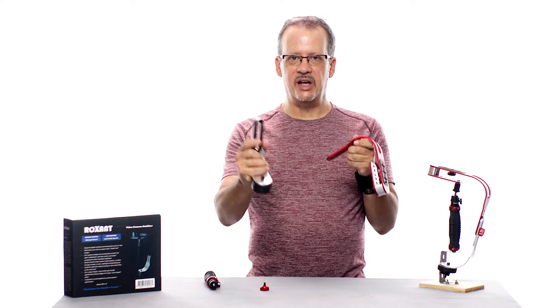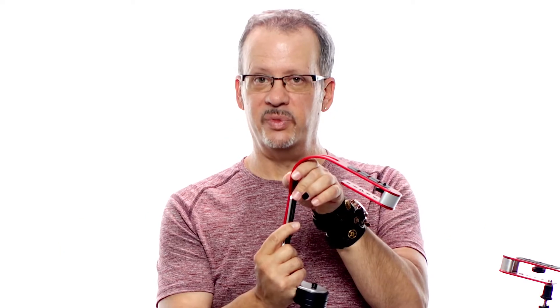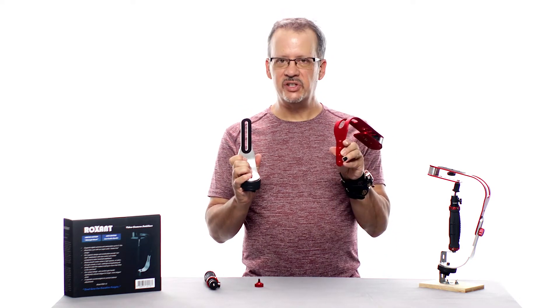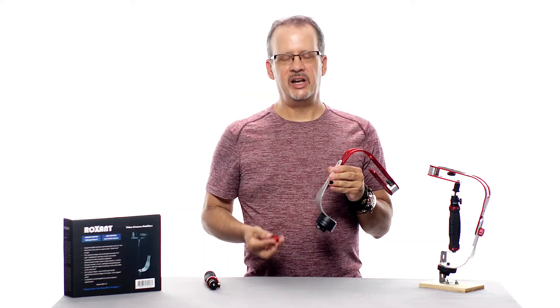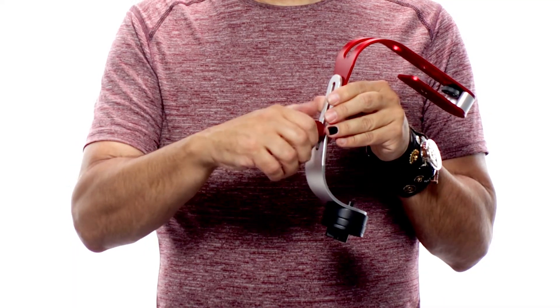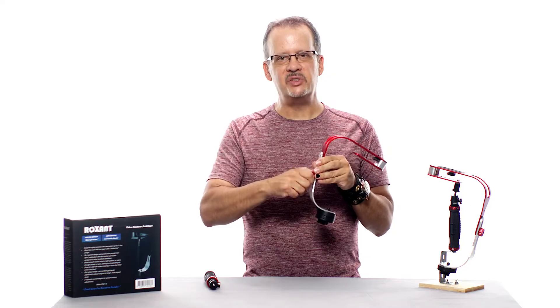It should not meet on the back side where it will be metal to metal. So we'll attach the gasket side of the lower arm with the front section of the top stage using our short bolt. At this point I'd like to attach using the lowest hole in the upper arm, as that gives me the most adjustability later for when we're balancing.